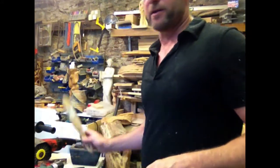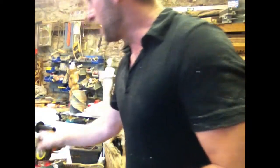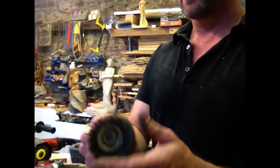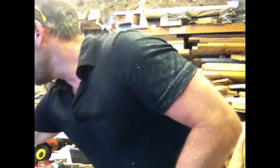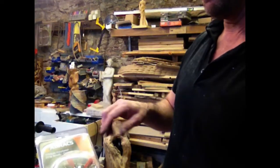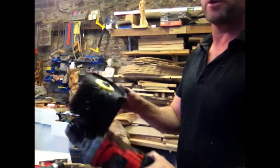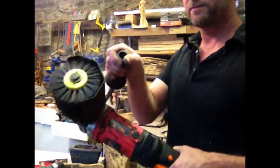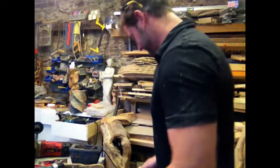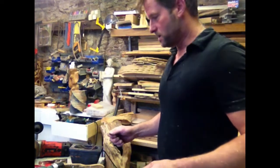Now to get this char off you can use a couple of things. A wire brush works well. A wire wheel fits in a drill. You can also get nylon wheels — they're softer and give a gentler curve. Or you can get these little flap wheels, which work really well. Since I burned this quite a lot, I'm using a brush sander. Makita make one of these for about £300; Katsu make one too. You definitely want to wear respiratory gear for this and do it outside.